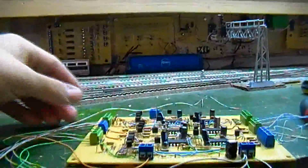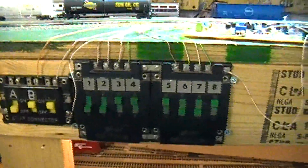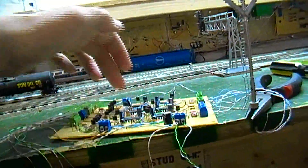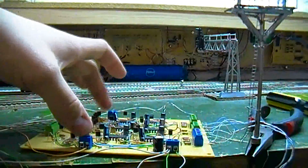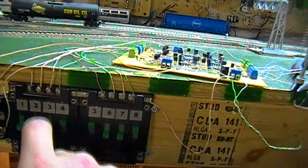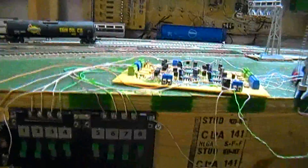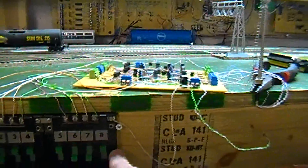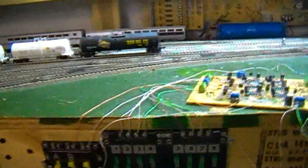I'll give you a little overview of the test setup. Coming from these inputs, I have my Atlas selector and connector switches that I'm using to simulate the inputs. These two switches are wired into those flash inputs — if you short out the two connections, that will give you a steady green; if you break the connection, it will flash. So I've got two wires running up to those so I can simulate a steady or flashing green. And then four switches: one for your marker light, red, lunar, and yellow. Of course, if every switch is off, you'll get a green and a marker light. Four switches for one signal head and then four switches for the other signal head.